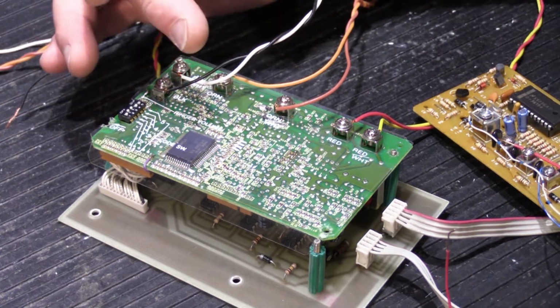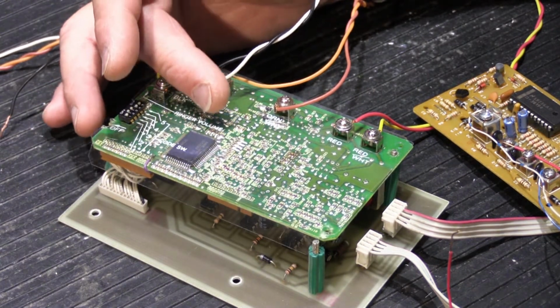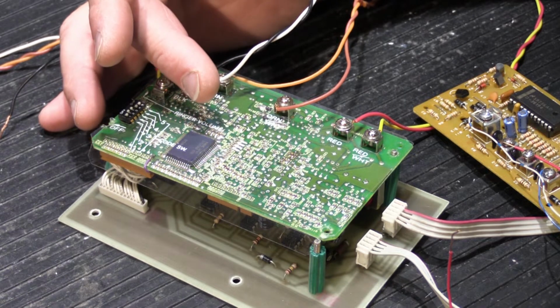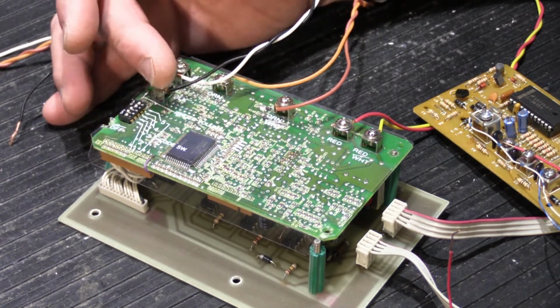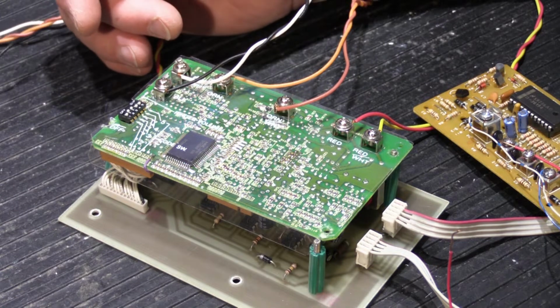There was another module that was similar to this. There was a door station module. It did essentially the same thing. You would connect your entry door stations to the module, thereby giving the door station an identification number, and you could call up the door station individually instead of doing a broadcast, talk and listen as the standard 5006 was. So there were some modifications that you could do to a system with NuTone's help.